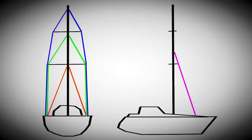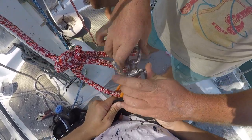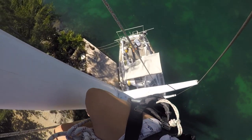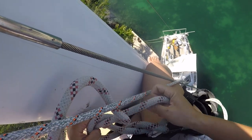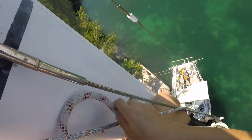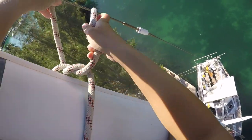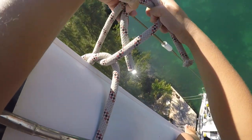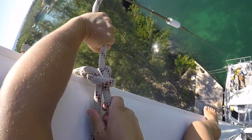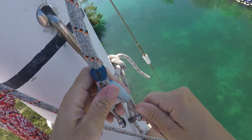I would go up again because the business of removing shrouds and replacing them is best done under a lighter load. The trick here is to tie anything that you can off on ropes or halyards. We like to always have two ropes or halyards attached to the human at any given time. We have two halyards functioning as headstays and an extra rope for sending stuff up and down, so I would tie myself off at the top with a safety rope, take that second halyard off myself and send it back down.